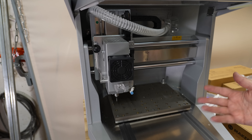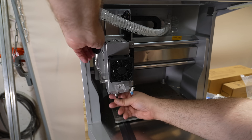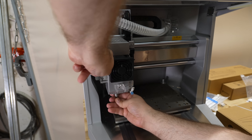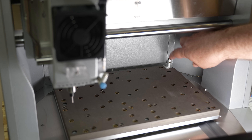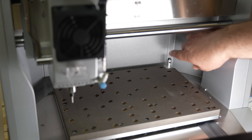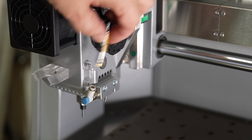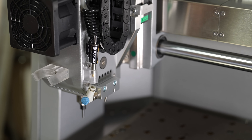The bigger brother has automatic tool changing; here we have to do it manually, but it's extremely fast — it can be done in 10 seconds. In the corner we can see the limit switch for the Z axis. When we change the tool, X and Y position should be the same while Z direction may be longer or shorter, and with this limit switch it will know the exact Z position. There's also a wide probe with a weak laser for previewing and checking the position of our engraving — similar to a boundary check or framing in laser engraving.